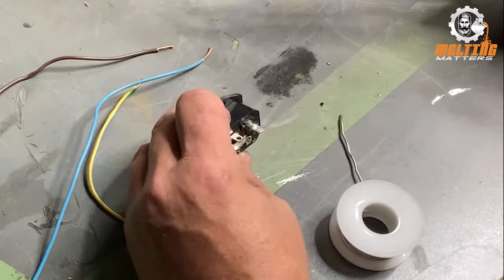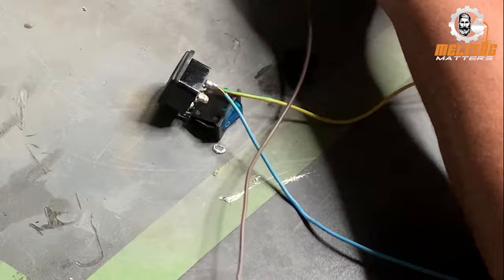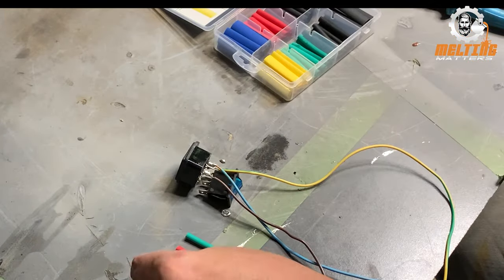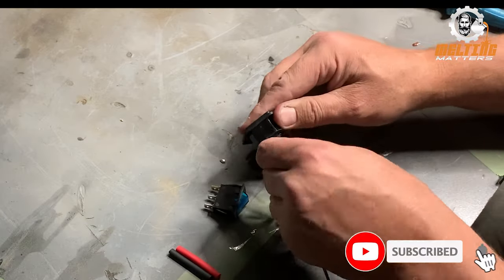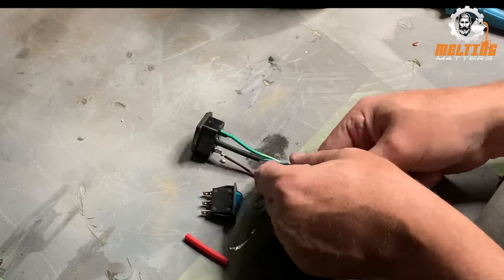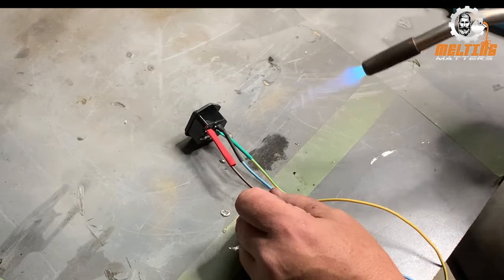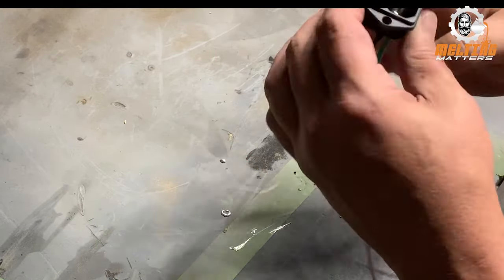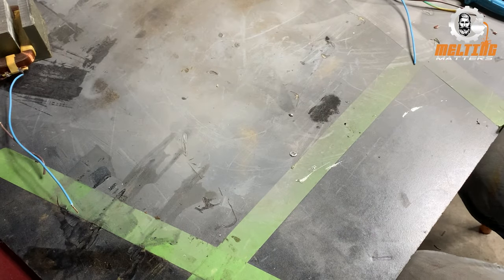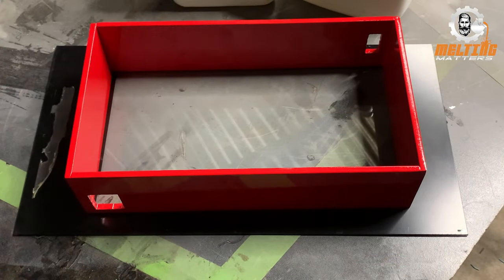I'm finishing up the power — there's an earth cable there, which you don't normally see on a DC circuit. It's there in case I ever want to throw a 240-volt plug in. When dealing with an electromagnetic vice, the key issue with AC power is that it's alternating at 50 to 60 hertz, so every time it switches back and forth it effectively switches off. If you're milling and there are sideways movements pushing through, you'll have trouble holding the piece in place. DC — direct current — will hold it much firmer, providing the constant current required to hold it down with force.